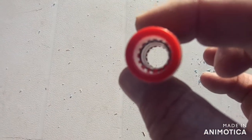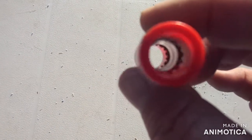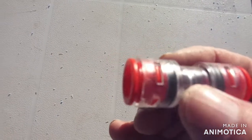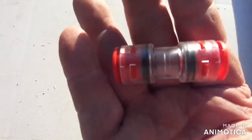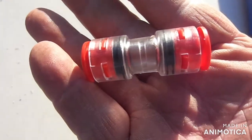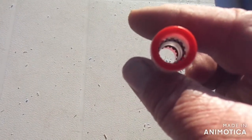Looking at the coupler on the inside, you can see there are blades. Those blades are to do proper cutting into your duct when you fit the duct inside the coupler. Make sure it's secured when it's through a manhole, because as soon as you put pressure on it — specifically when you do DITs and pressure tests — if it's not cut into your duct, the coupler will come off and you'll basically have to redo it.